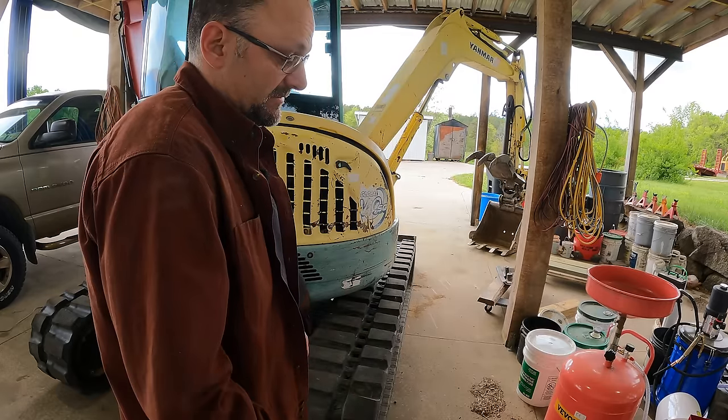Remember when I changed the hoses, I put those hoses on the opposite side and vice versa. Well, that'll tell me if it's the motors or not, if it changes sides. Well, I can do that again. If I hook this up to the opposite ports on the swivel joint, they're the same size. Now, left will be going through what right was going through and vice versa. If it switches sides, then the problem is the swivel joint. If it doesn't switch sides, then the problem is the valves. Why didn't I think of that before?